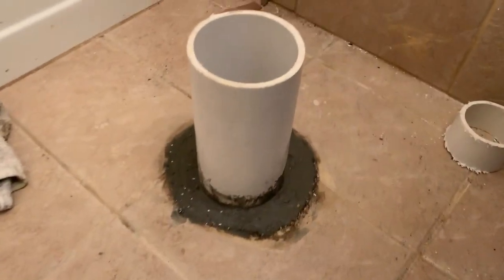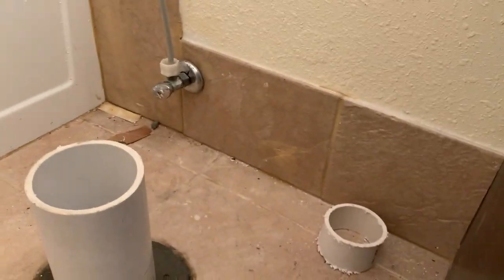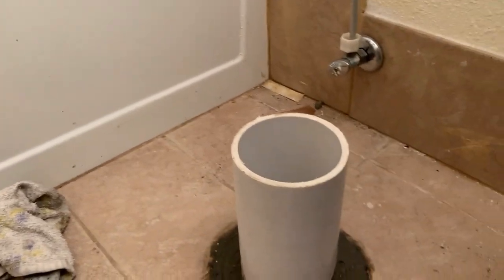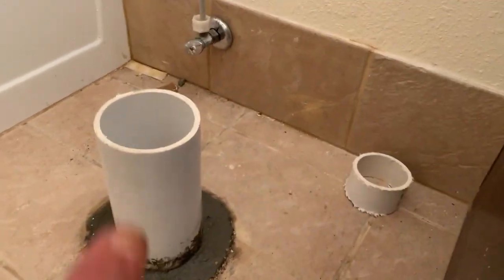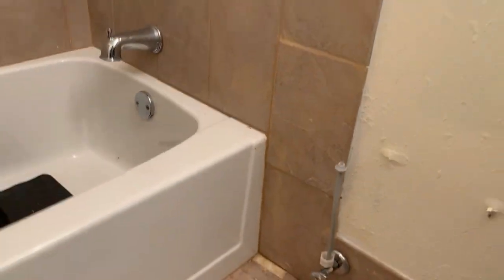So I actually had some help show up today, a couple guys helping put the stuff back together. We did get all the cast out. We'll stick it with the bathroom. Broke the toilet up, ran line in there. On the other side, we broke it open and tunneled underneath the tub and took the old P-trap out. And now we're running everything back out the same way. We didn't have to really do any damage inside of the bathroom.